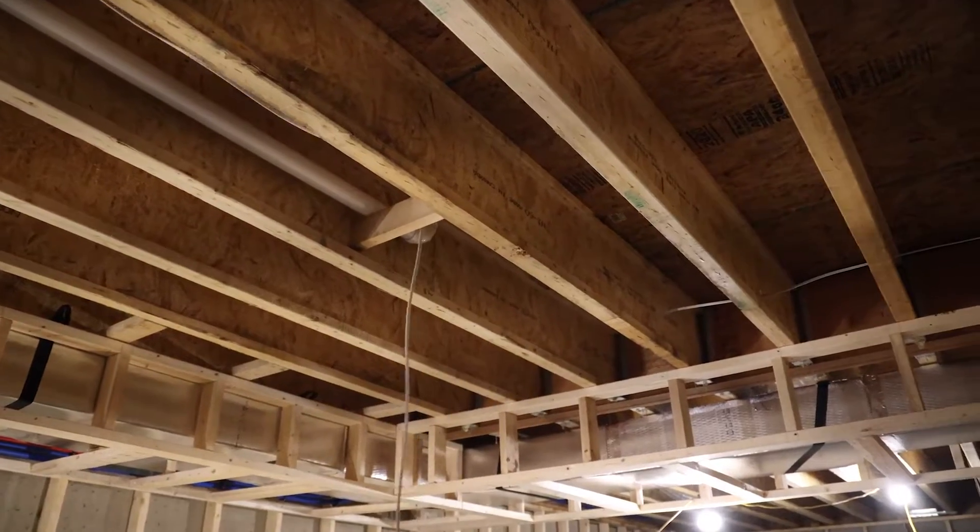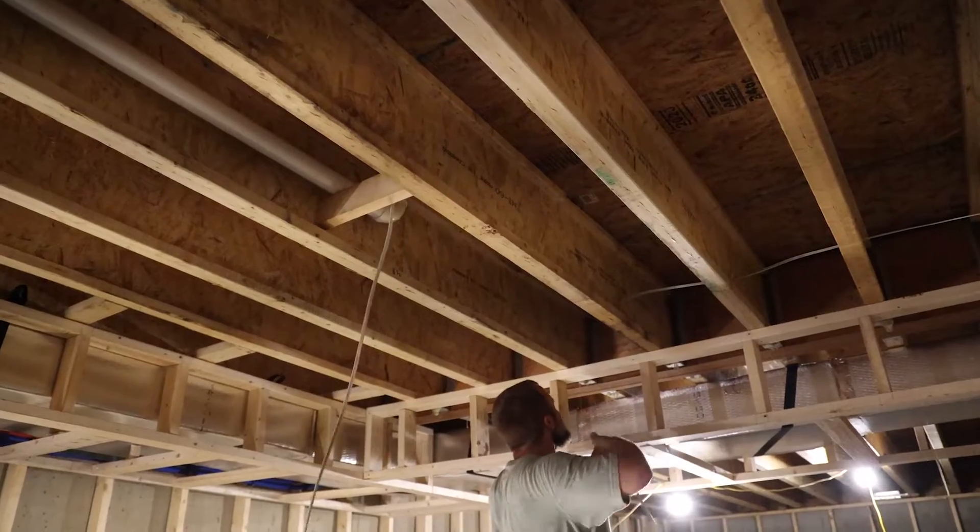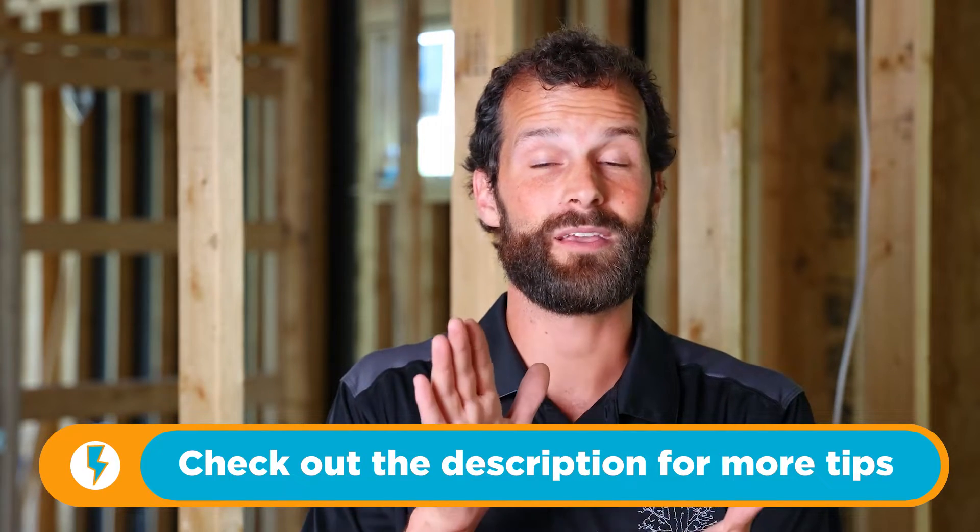Future consideration for protection from physical damage includes wiring that's run on top of floor joists in an attic, where a homeowner at a later date may expand their storage by putting plywood on top of that wiring — and that wiring is now being physically damaged. A friend of mine had a dishwasher where the wiring connector that protected the wiring where it entered the wiring compartment popped loose. The wire was no longer protected and was in direct contact with metal. Dishwashers vibrate — houses actually vibrate — and things that are not secure or resting on sharp or rough edges will work over time. He walked into his kitchen one morning to the smell of an electrical fire at that wiring compartment. So protect from physical damage both during installation and after installation.